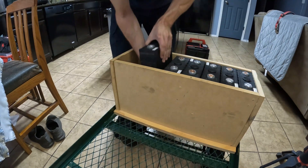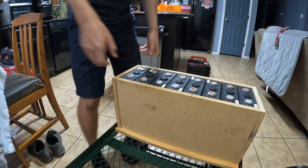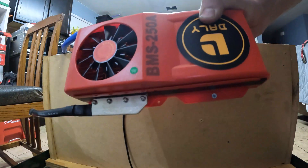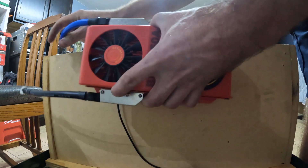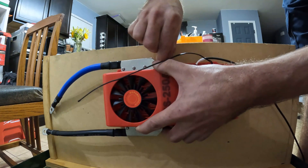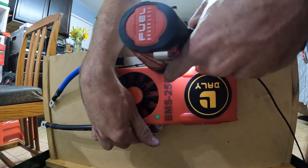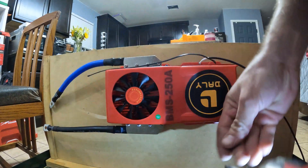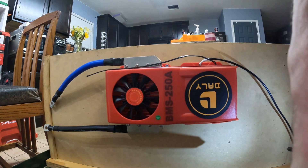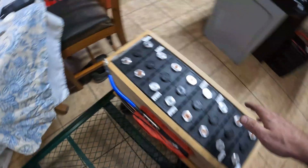I hope this is the final time I've got to move these. Last battery loaded. The DALY part is going to be upside down because my main negative is up here, but that's okay. This is a temp sensor. I've got to get better at making these videos. One day I can achieve my goal and build batteries and do all kinds of fun stuff. The BMS is now mounted. Now I've got to put all the bus bars, connect that, put the balancer on, and then this battery is pretty much complete.